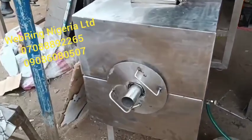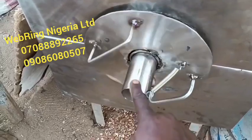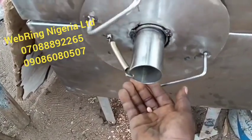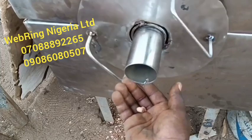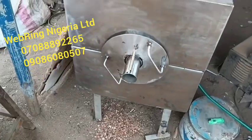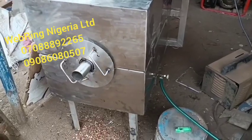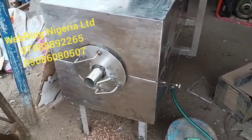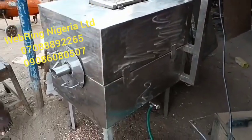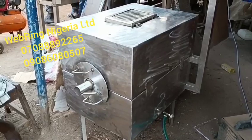There's something very interesting — you may need to check the groundnuts as you roast to see if they're well roasted. You pull this pipe out a little and release it, and two or three nuts will come out to give you an impression of the level of roasting inside. You do that from time to time to get an idea of what's happening. Once done, go to the control panel, depress a switch, and the entire barrel is emptied. The machine comes in different sizes.